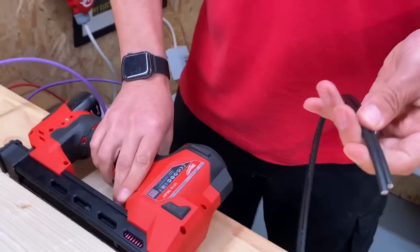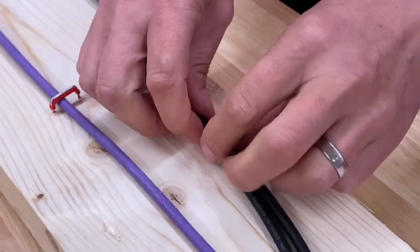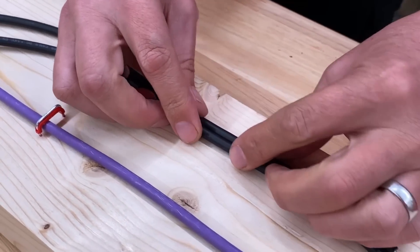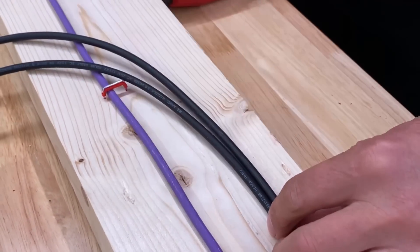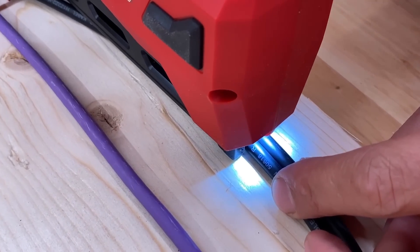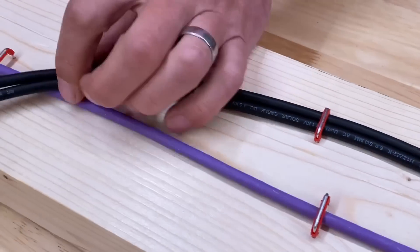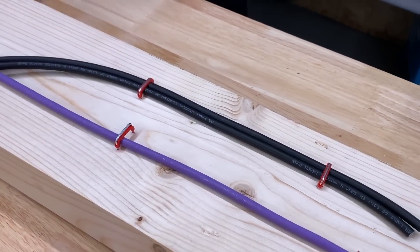So you're going to bring in something that looks like a coax but isn't — we haven't got any coax to hand, but we have got this solar cable. Don't cut through this thinking it's coax — you could have an accident. It's very well signed along its run. We're just going to try these side by side as if you've got a set of strings, where you'd have a positive and negative connection, so they always run in pairs. Yeah, that's doing a good job — probably running this through the roof space from the solar panels down to the inverter. Side by side, two round cables, pretty straightforward.